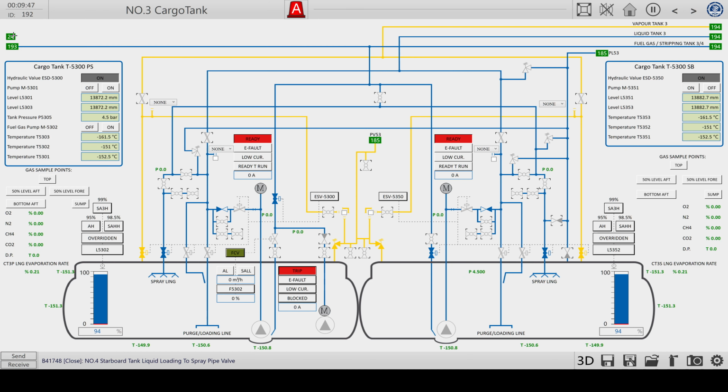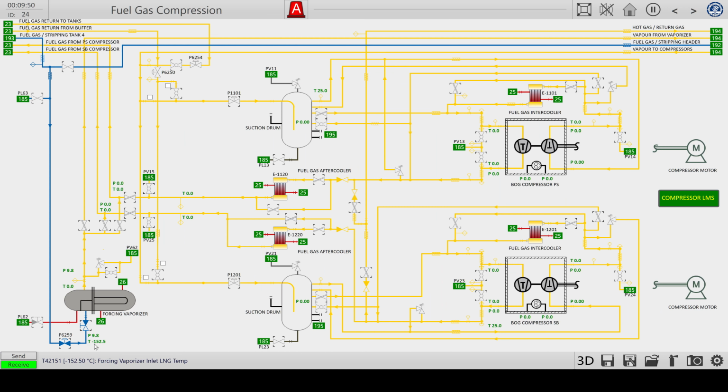Going back to page 24, you see we now have pressure from the liquid LNG, minus 152. We're going to heat it up and put it into the buffer fuel vessel via these two valves. I already have pressure there. We're not going to use it at the moment, but I like to fill up these two drums also, in case later on we need other systems. This valve should open automatically.